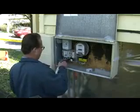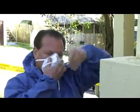Next, pull out the fuses and wet the area with water mixed with a suppressing agent such as PVA glue, which will help contain the asbestos product. Make sure you put on your PPE with care. Start with boot covers, then the overalls, then add the disposable respirator and make sure you fit check the disposable respirator to your face.